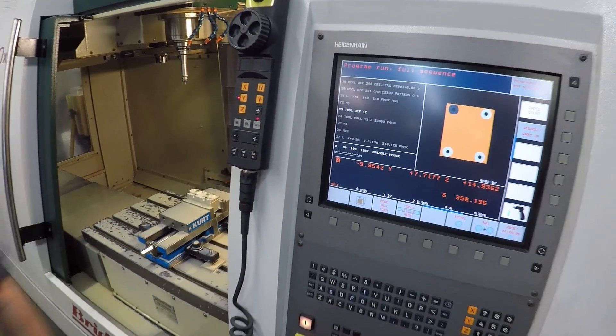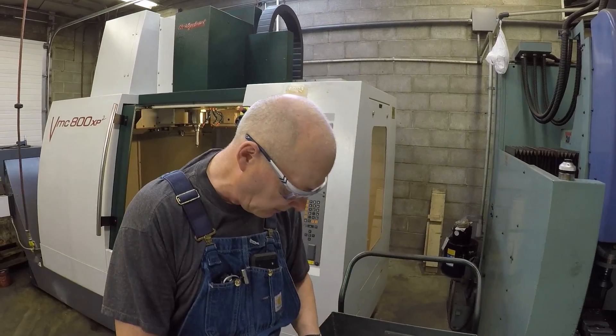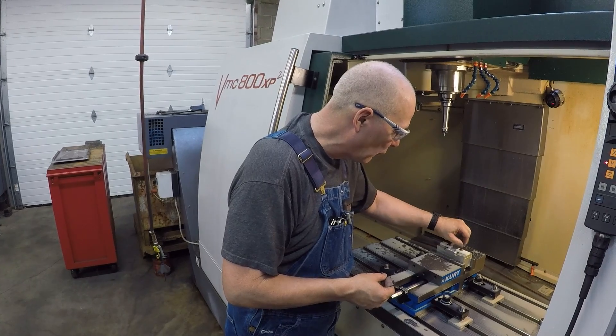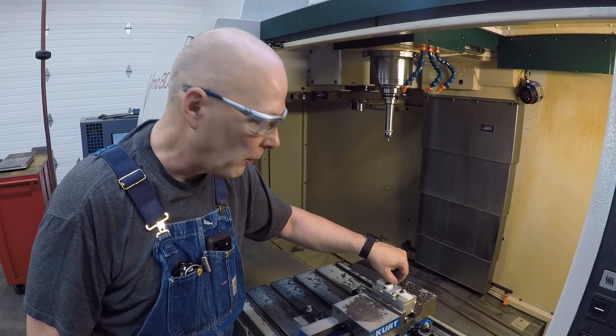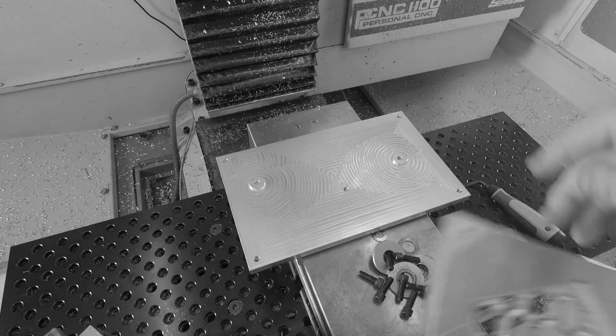If you look at one of these closely you can see right here where it's got scratches — so we made these little pads. They started out as a rectangular piece and just got machined in the process. I make sure I put all these clamps in place before I take the original ones loose, so we have everything machined on the outside to the hole pattern. We'll add this video onto a page on our NYC CNC site that talks about precarious fixturing methods including vacuum chucks and super glue.